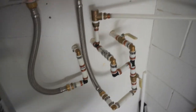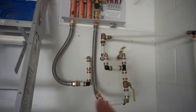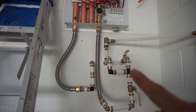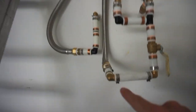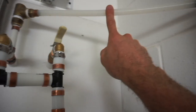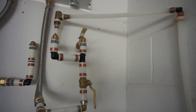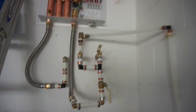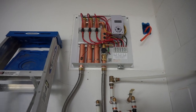So I know I told you guys we're learning together. Here's what it looks like — I have everything hooked up. This was the way I ran the lines. Hot water is here — I just changed the angle of all these PEX pipes coming off there, and the cold water is right here running straight up. I'm gonna put a 90 in this vent hose and run it parallel with both edges so it'll be tucked in the corner. I just got to put the outlet in up there, but I'm just trying to get us some hot water.